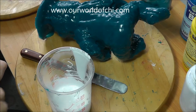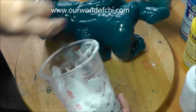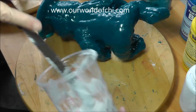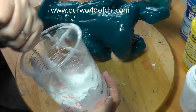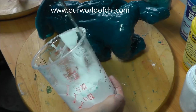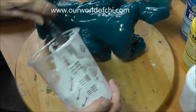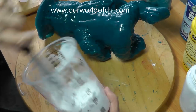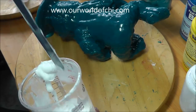I'm putting equal parts A and B in the pot and adding some white pigment. Then I'm adding a few drops of Thixotropic — called Thivex — just to thicken it up so I can thicken the seam. It takes a few seconds for it to activate, so it's better to mix it around before deciding whether to add more. I want it so that it will take its own form and hold its shape.